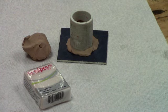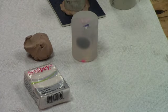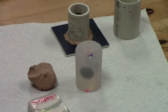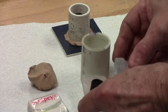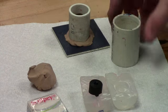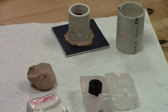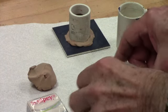Here's an example, I'll open it up, of a mold that was done for one of the parts on the Wilton vise. This setup was very similar to what I demonstrated on the penny, but here's the mold. After the RTV material vulcanizes overnight, you then take it out of the tapered frame and cut it with an X-Acto or razor knife and part it the best you can down the center line. And it's not that critical, as long as you can get the two pieces to go back together. The black piece in this case is a core,